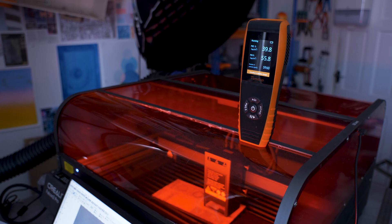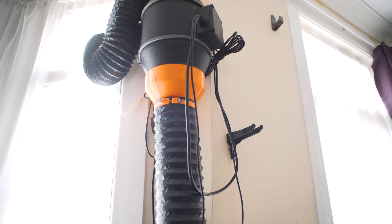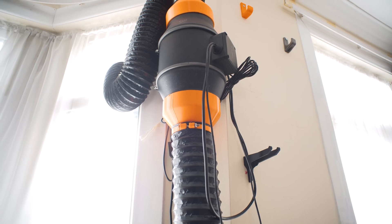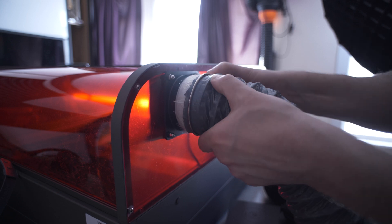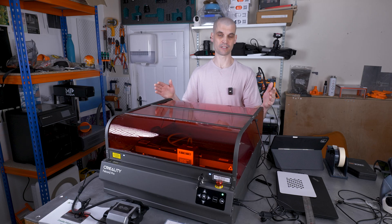This isn't too surprising — we are comparing a small integrated fan against a full fume extraction setup. But it does highlight one key point: even with an enclosure, you still need to think about proper fume extraction and preferably filtration when doing laser engraving. You should probably invest in a good extraction fan even if you're using this laser engraver.